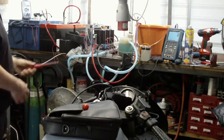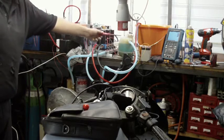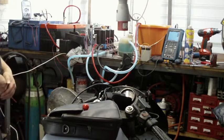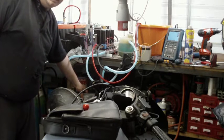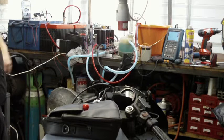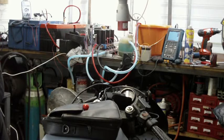we have now gone to 48 volts. We've got extra batteries. I've hooked up the cooling system, so we have our tank, pump, battery, pipes, radiator, and I've got a fan here just blowing a slight breeze through the radiator core to just kind of simulate driving along at a fairly slow speed. Let's say that silly desk fan is putting out probably maybe 20 miles per hour tops.